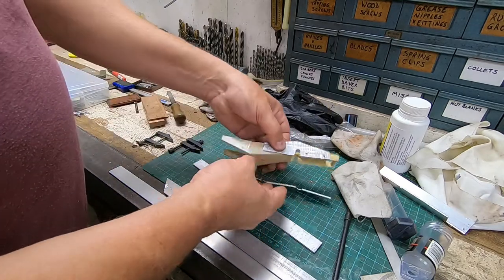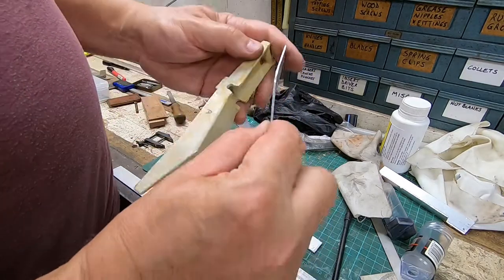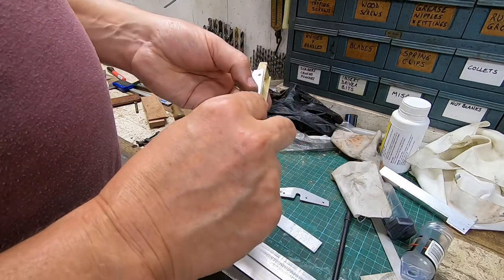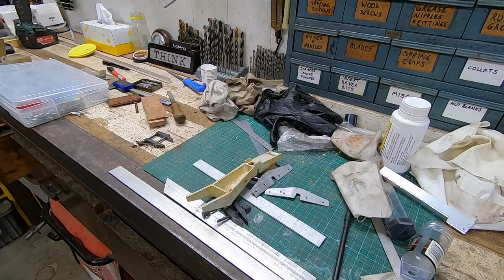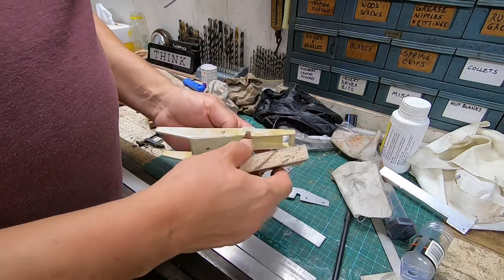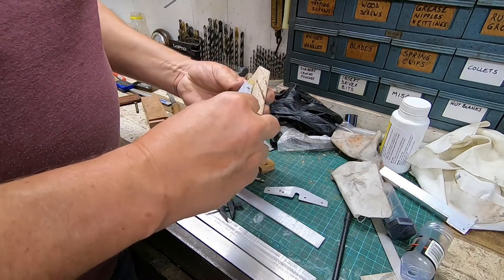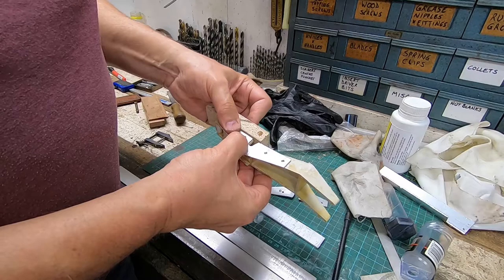I'm going to clamp the right plate in. I had to bend the plate to make the shape - it's a 10-degree bend this way and tilted 10 degrees as well. It wasn't that difficult to sort out. I had to label them so I didn't get confused about which way to bend them - it's easy to make two left-handed ones instead of a left hand and a right hand.